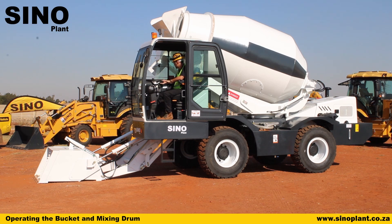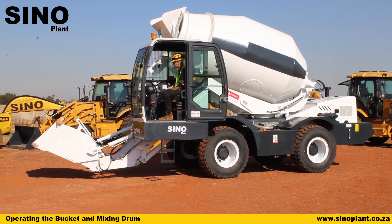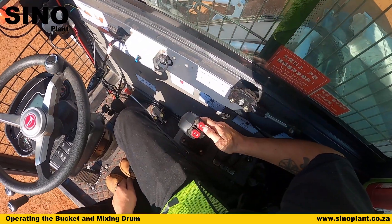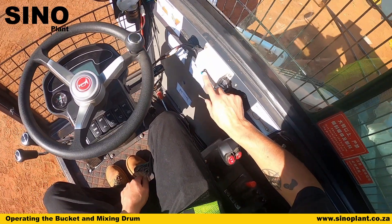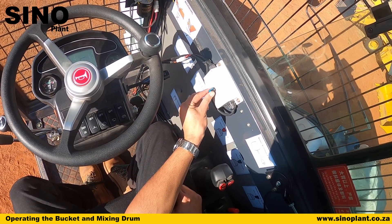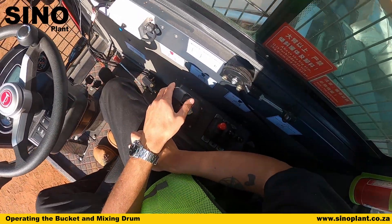To use your vibrating motor, always make sure the bucket is lifted slightly off the ground and always remember to curl the bucket all the way up before lifting it any further. Your vibrating motor is found on the bottom of the skip. Turn the knob between setting one and nine depending on how intense you want the vibration — you can start from low and go all the way up. To switch it off, just hit the toggle again.